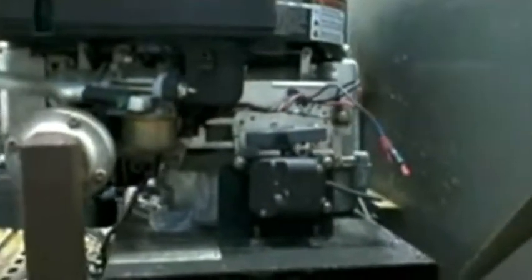Most important is the choke. Make sure that moves. What we're going to do is still spray each linkage. We're going to grab some WD-40 or a silicone lubricant, and we're going to spray each linkage to make sure it's ready to go next season.